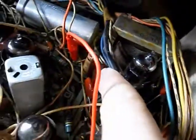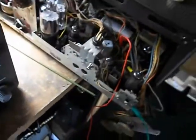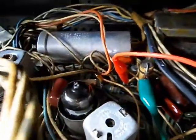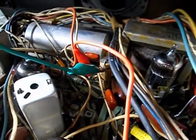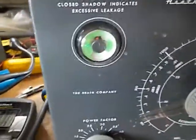It'll go to this lead once I clip it — I have to clip it first to test it, and I don't have my diagonal cutters out here, so I'll have to come back in a minute. Okay, I've got my diagonal cutters. I have one lead connected to that post which I identified as the bottom of this cap, and I cut that lead to isolate the cap from the circuit.